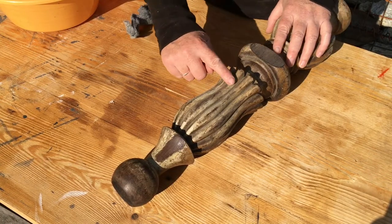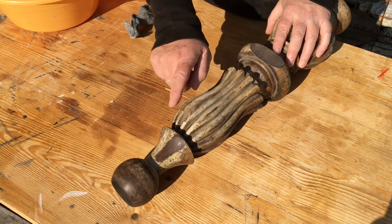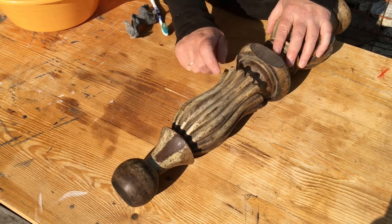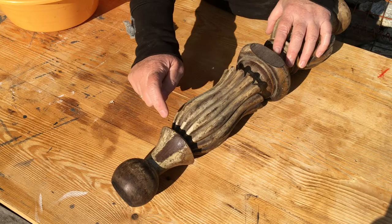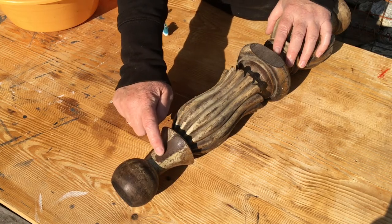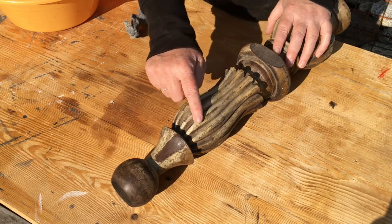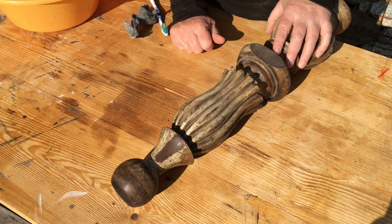As you can see, there are white marks on the wood. This is from shellac — it's gone old and discoloured, so we've got to remove that. We do that with some spirits. As you can see here, we've tried it out and it works quite well. Seb has applied some, so what we're going to do now is apply spirits everywhere and get rid of these white marks.